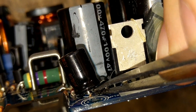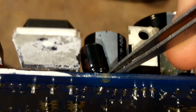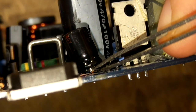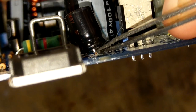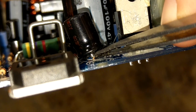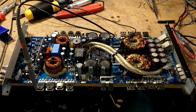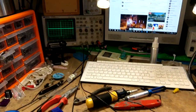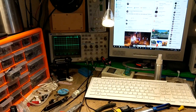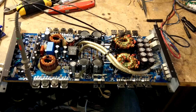The via at the top was not connecting properly to the capacitor. It was soldered from the bottom so the bottom trace vias are connected, but on the top there's no solder, so this lifted trace here isn't actually connected to the cap. That just needs soldering properly and it should work. After fixing that joint, I'm curious to see whether the amplifier will now turn on and build the Class D wave without any RCA help — because it was giving a little pulse occasionally before even without RCAs in.